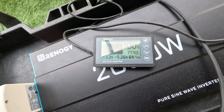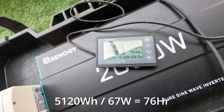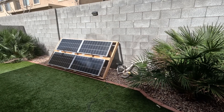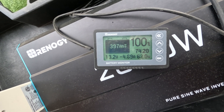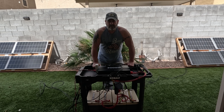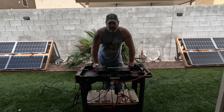We're still at a negative 5 amps between four panels — that's 400 watts of power. Two panels on top wired in series, and two panels on top wired in series. As you can see we're still in the negative, but it's fluctuating — we're getting roughly 90–120 watts. Based on the battery monitor, we can run like this for about 77 hours. Being able to run two refrigerators off this cart is a win. I'd definitely want to rearrange my panels to maximize charging input.